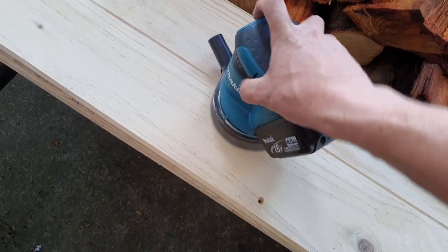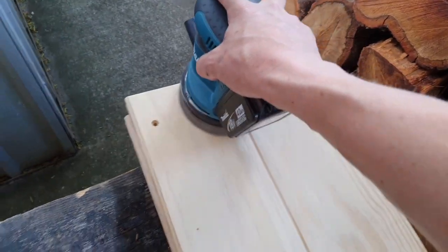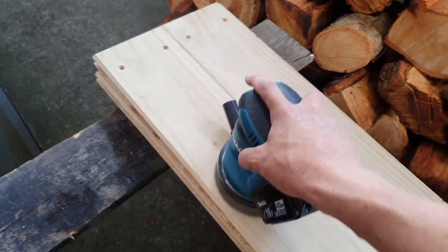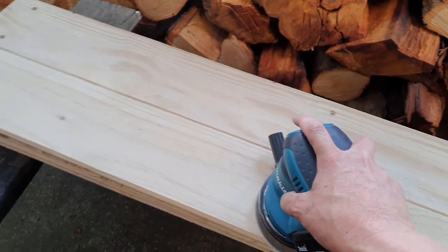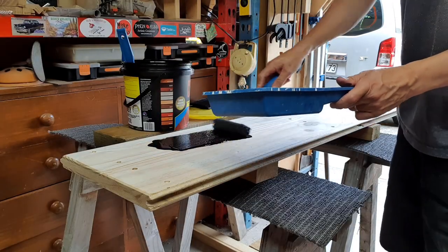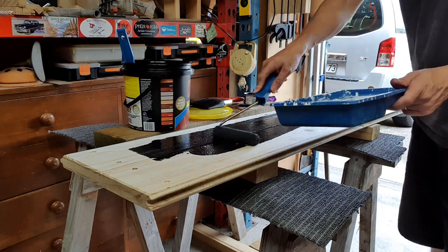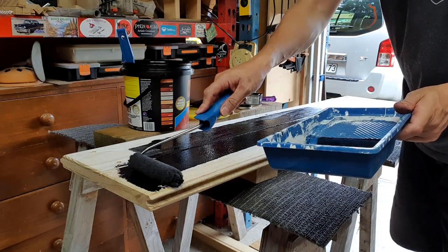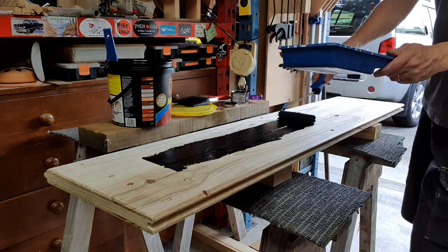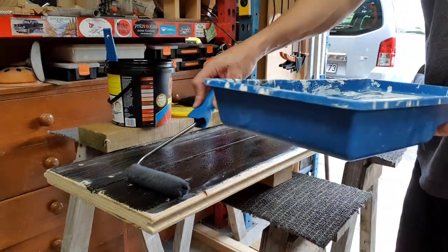Before I oil the boards, I give them a quick sanding to 80 grit, mainly to provide a consistent texture in the wood to soak up the oil evenly, but if there's any mill glaze or little dags or nasties, this sanding will remove all that too. The oil goes on super easy. I'm using a mini microfiber roller and it took no time at all. The recommendation is one coat initially. Further maintenance coats are required later on, in about a year or so I think it is.